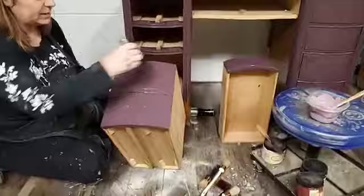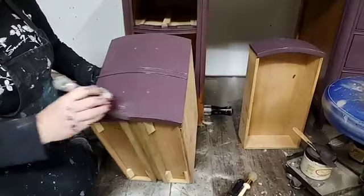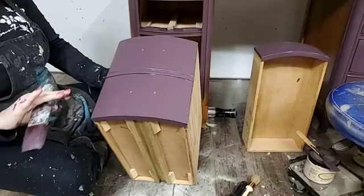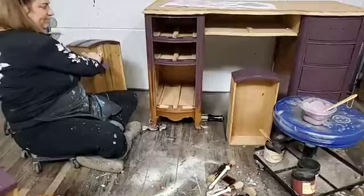I've got a beautiful base coat on here — my brush strokes are nice and soft. You can go over the very top of them with just a really soft hand to feather those brush strokes out. With any self-leveling product you want to avoid going back over it once it starts setting up. My paint is still nice and wet so I can brush it, but once it starts setting up, avoid going over it or you'll pull brush strokes into it.